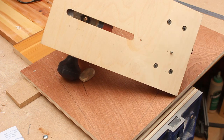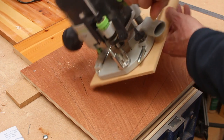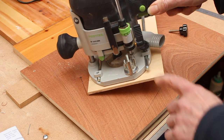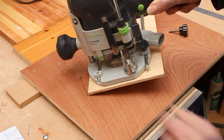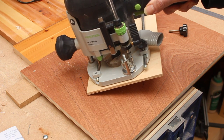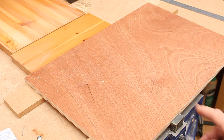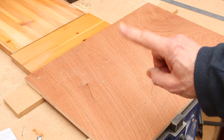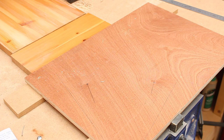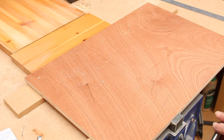I've set the depth on the turret as usual — one stop at full depth and one for a half plunge to start. I've put the dog on the vise up as the moving dog. I never did get around to drilling dog holes in the workbench, but I've got two bits of wood against the wall to hold the workpiece steady on the vise as I rout the slot.